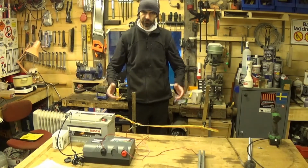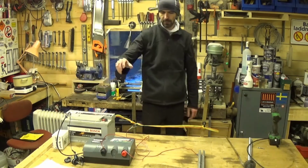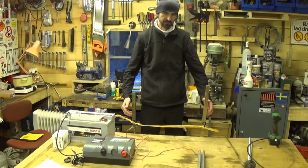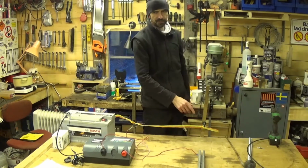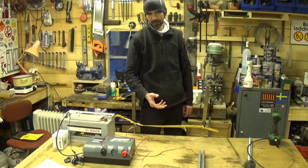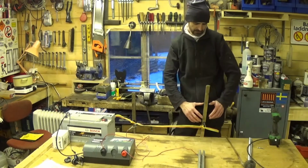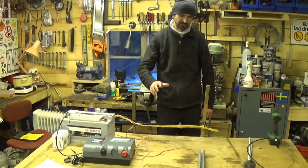And that's how it works, and a little bit about why it works. Power source, energizer, ground posts, normally 2, sometimes 1, posts of some description, and a third option which I didn't get to. The third option is to take these isolators and screw them right into a tree. That does work. It's not great practice to screw stuff into trees, and if you leave them there for a long time the tree will grow around the isolator and into the fence. Not ideal, and don't screw stuff into trees.